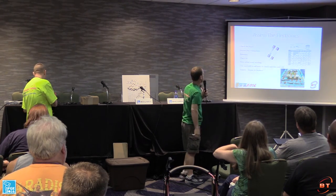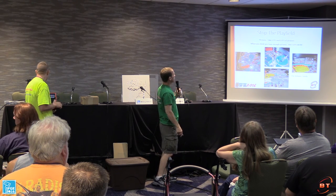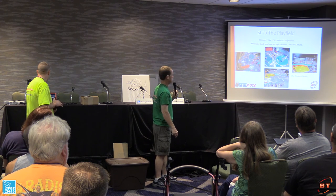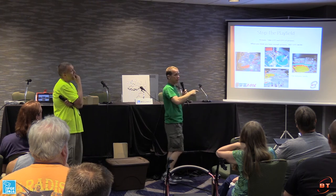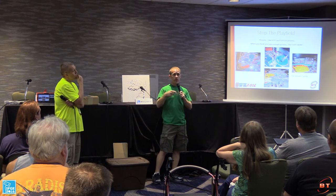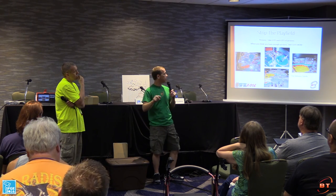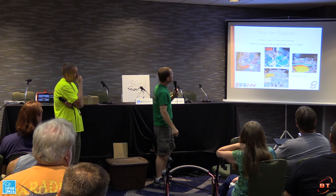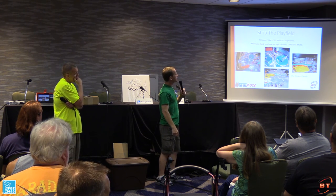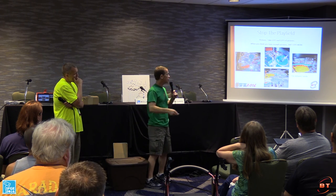All right, Whitney, next slide. All right, so we're going to strip the playfield. And you want to take lots and lots of pictures. And I say this, and I really mean this. When you think you've taken enough, take a lot more. I have done several games where I just wish I had a slightly different angle on something. And what you're trying to capture, it's a little washed out in the lights here, is the orientation of everything. What posts were used in what position?